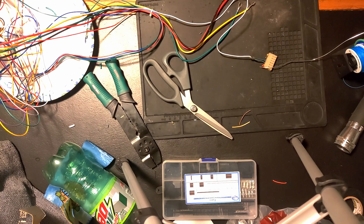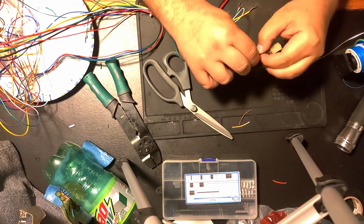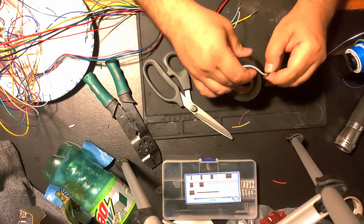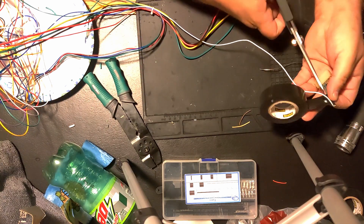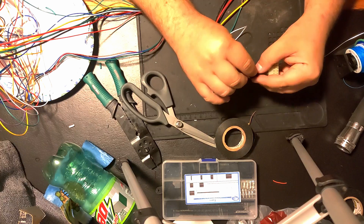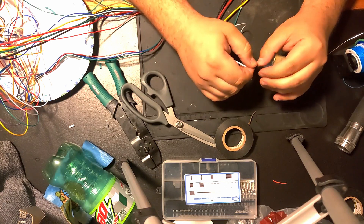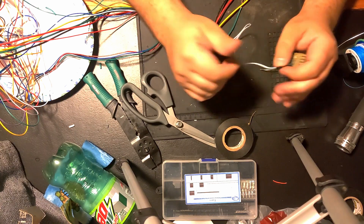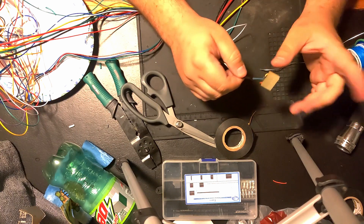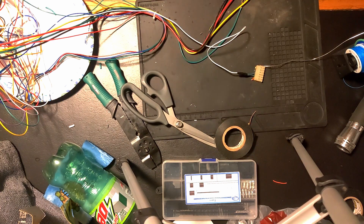Since we're not going to use any heat shrink, just to be safe, we'll throw a little electrical tape around it. Now we're also going to need to do a little work on the JAMA harness for the sound circuitry as well. There's a quick-disconnect connector up there that runs the sound circuitry. But honestly, given what we've done, I'd like to hook it up to power, hook it up to video, hook it up to the monitor, and hook up the Pandora's box — and just see if we can get an image on the screen.